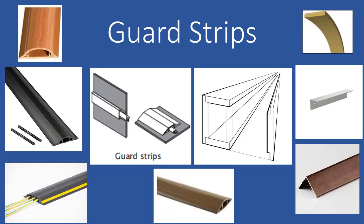Another way to protect your 120-volt wire in the storage areas would be by the use of guard strips, as shown by the various photos in this slide. Also, non-metallic sheath cable routed closely between two pieces of cleat stock would be considered protected, provided it does not extend beyond the outer edges of the cleat stock.